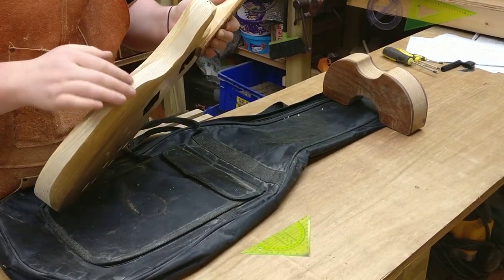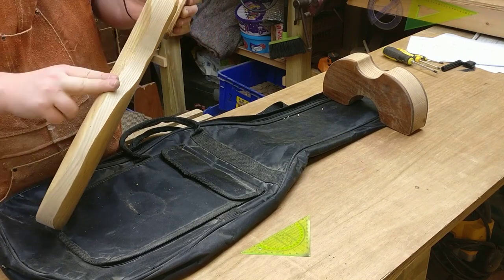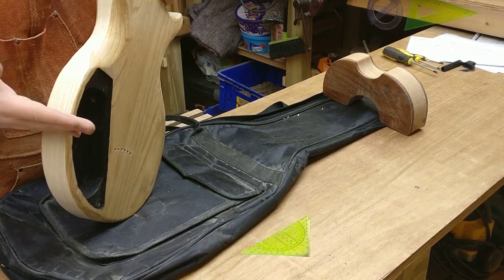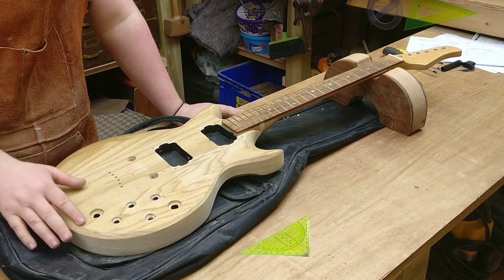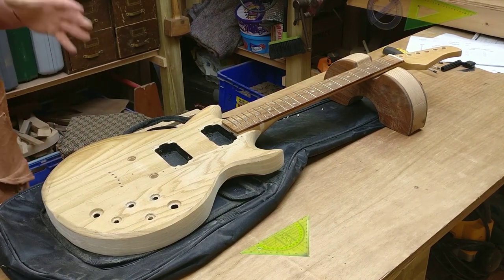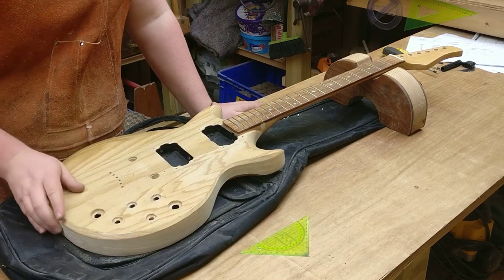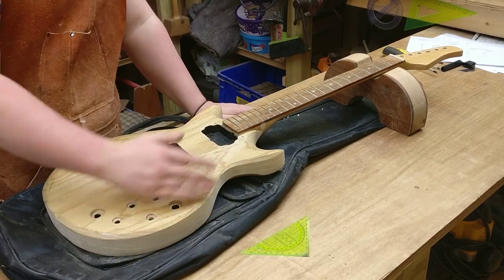You can see the difference - the raw wood is whiter where the sander hit, and there are lines that don't flow, they're wobbly. This area wasn't at 90 degrees either. When I made this originally, I didn't use a router to do the profile - I did it all by hand, probably with a hand orbital sander. This is much better with the spindle sander - it holds everything at 90 degrees and everything is nicely squared.